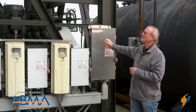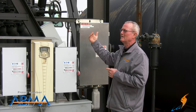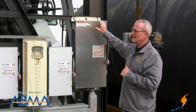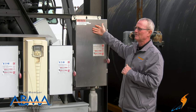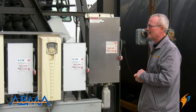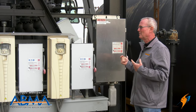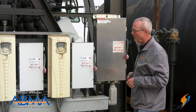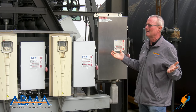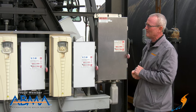We don't just use them on these units that are designed to operate outside — we use the NEMA 4 on inside trailer units and mobile units as well. We use those to keep moisture, water, and dust out. Outside, it's going to be raining on it, so if it's not watertight you're going to short things out. Inside the trailer units, the issue is the guy who comes through once a week and washes the unit out — he's going to hit the walls. You can't have that thing shorting out. And if something happens and they freeze a line up during the night and it pops open and sprays water everywhere, that thing needs to be watertight.